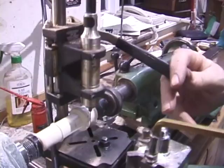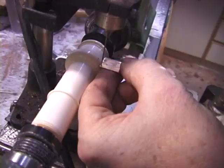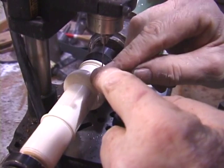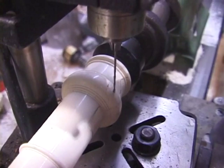Here's a little setup that we use to precision drill the cross hole for the hinge portion. This little piece of metal helps to start the hole. Ivory, you see, will clog up the tool, so we go in with plenty of wax lubricant there, and we go forward in small stages, cleaning the chips out as we go.